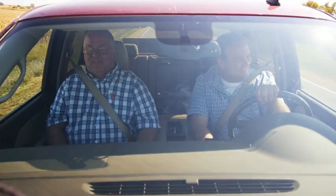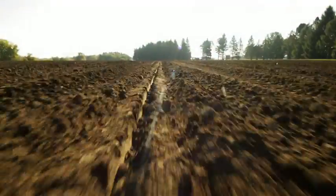They were telling us that we needed more productivity — we needed to go faster speeds. So we determined through a lot of customer fields, a lot of digging, a lot of evaluation that through high speed video, we can see that the seed is bouncing and rolling coming out of the seed tube when you run faster.